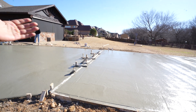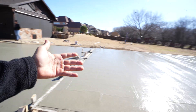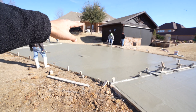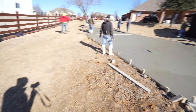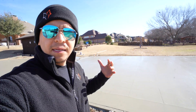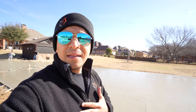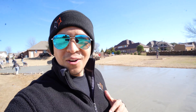So that way you don't have any water approaching the building. It's also important to have a driveway that doesn't direct water towards your building based on your landscape. For example, the home is up on the hill and all that water is going to run down here, but we lifted this corner a little higher and redirected the water to go around the building. That's how aesthetically — even the forming of the concrete — is going to match your metal building. I really want to emphasize that, and it's the reason why I decided to offer concrete with our metal buildings — I don't want you guys to go through water intrusion problems.